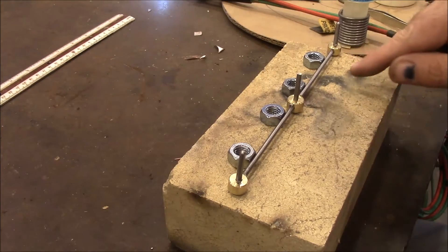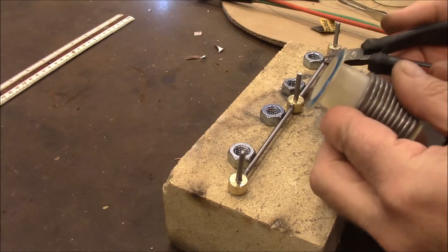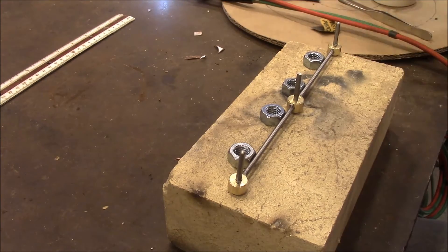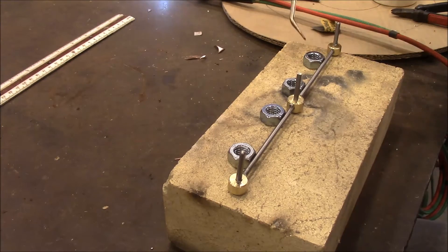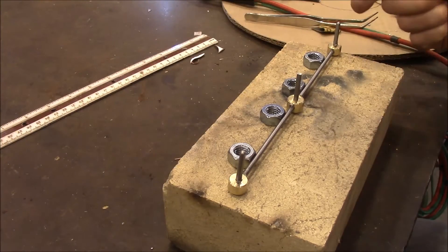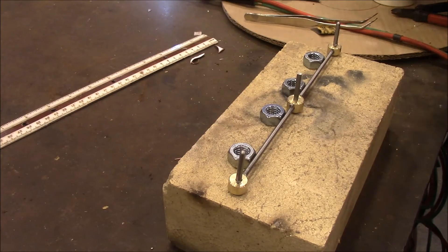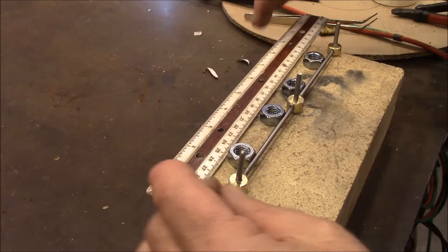I've got this all laid out. I took some side cutters and cut some pieces off of some lead solder and laid those at the joints. I took these nuts so I can kind of stand off from the brass pieces and used this to get it lined up. I can sight down these rods and they were all lined up — hang on, I must have bumped it.